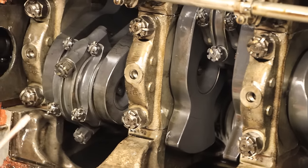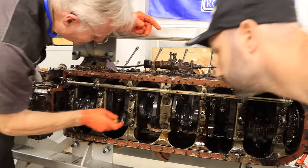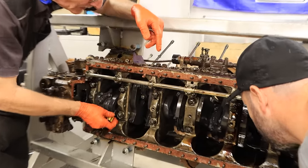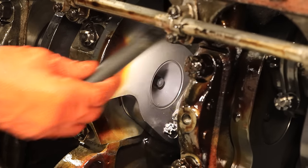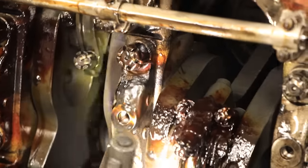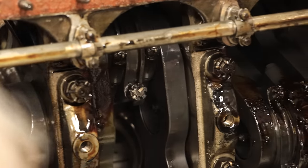We can put the crank up on our rotator — it's quite a large bore that they've drilled out through the crank pins and the mains. They've put those steel cups in there and they just bolt in — clamped in like that. They look like just a little half-inch nut holding them in there. So that's in the centre of the main bearing, on the centreline of the crankshaft. That's probably one of the big ends there — you can see the castle nut with the split pin, and there's one in the main. All that drilling was to lighten the crankshaft and overall weight of the engine. For an aircraft engine that would have been a great benefit. They could have just done direct shot oiling or cross-drilled it and left it solid for the tank application.